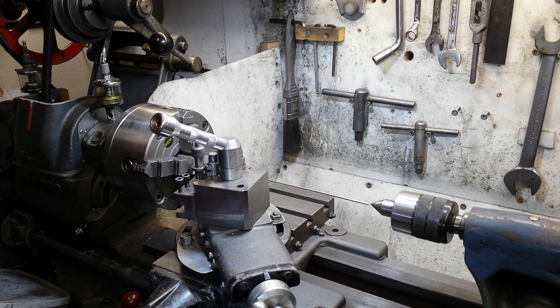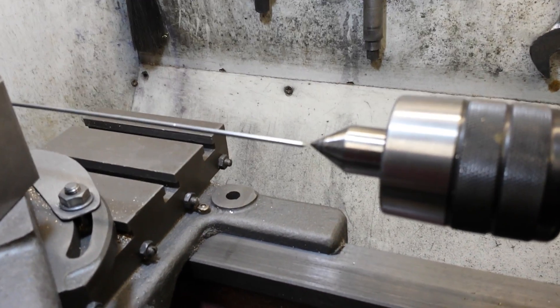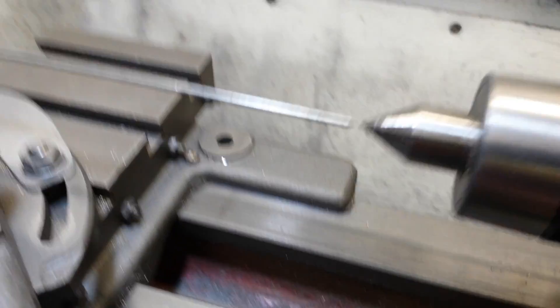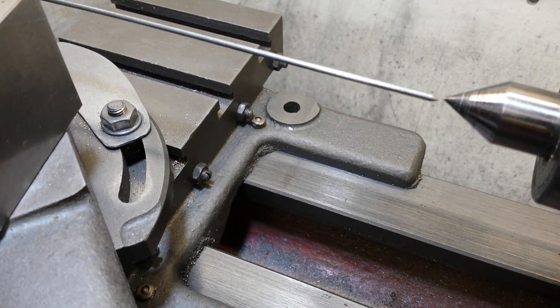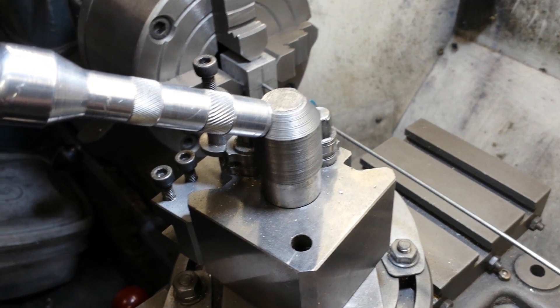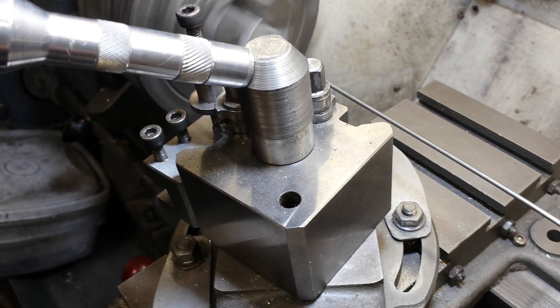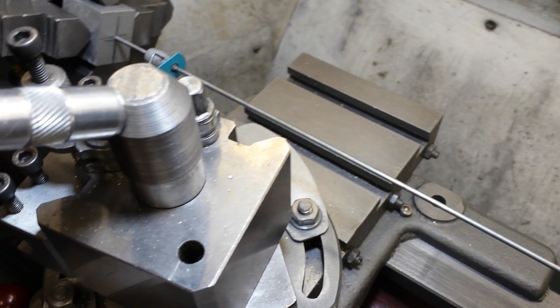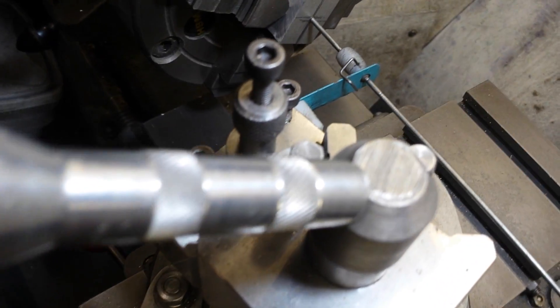Now as you can see there's virtually no movement at all. If you power the lathe up, you'll see that there's hardly any movement there. You can carry on until that movement disappears completely, at which time that center punch mark is exactly aligned with the central axis of the lathe. It depends how accurate you want to be — at the moment that's not too bad, and unless it was really critical I'd be happy with that. That's the wobbler — you can make your own, dead easy. It's a cycle spoke, a plastic bead with a tapered end sitting in a hacksaw blade. As easy as anything, and as useful as you would not believe.